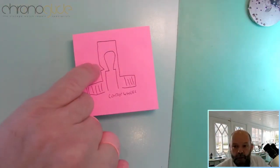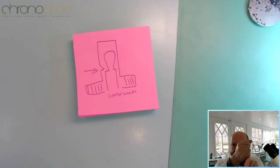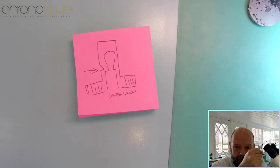That very small indentation means the friction of the cannon pinion moving around the pivot of the center wheel. If it's too loose, the movement will run but the cannon pinion will remain still and the hands won't move. If it's too tight, there's way too much friction for the cannon pinion to move and the pivot might break. There is the tricky bit.